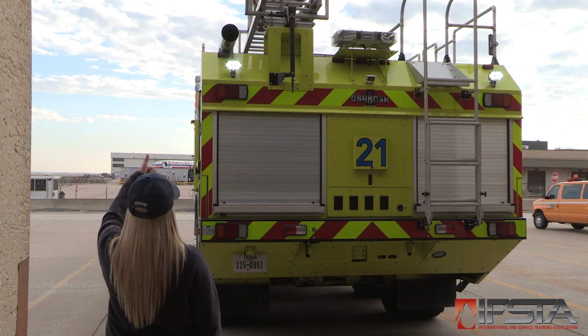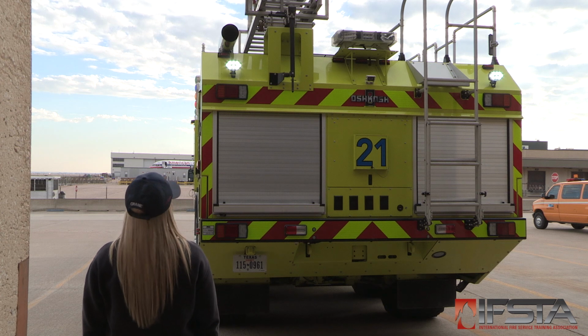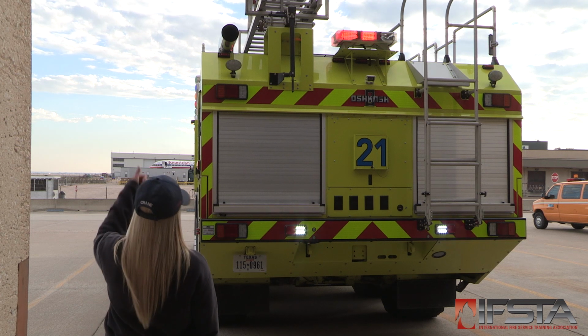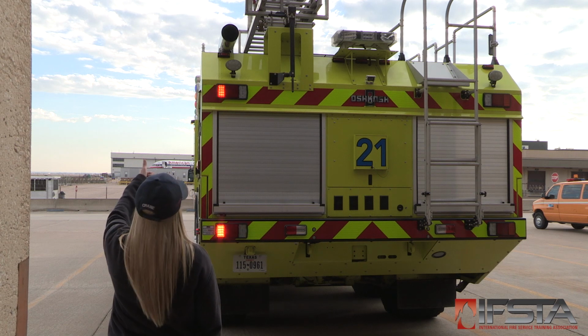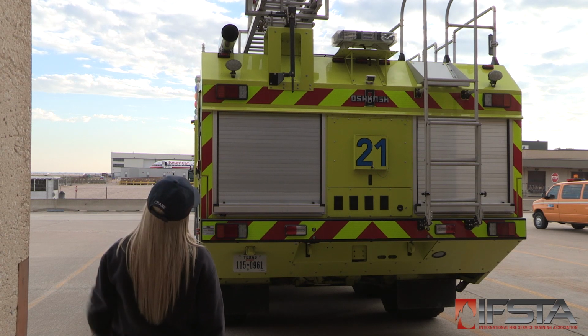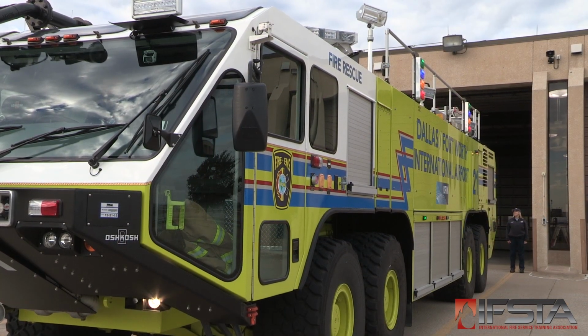Second firefighter, operate all rear running and emergency light switches in the cab one at a time, calling out switch type to the inspecting firefighter. Check all running and emergency lights as they are activated. Be sure that they are functioning properly, that all bulbs are working, and that lenses are in place and not cracked or broken. Check the brake lights and reverse lights.